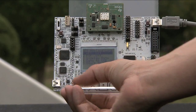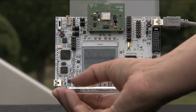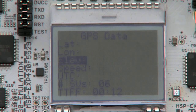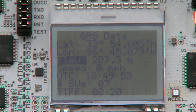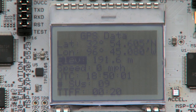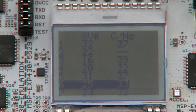We'll select the GPS applications menu, turn on GPS and push-to-fix by using select 1. Now we will go to the display menu and wait for the CC4000 to get a location fix. When the GPS solution gets a fix with the satellites, the data menu is populated. Here you will see time to first fix or TTFF, latitude, longitude, elevation, speed, UTC or time, and number of SV or satellite vehicles. Now you are seeing this data on the display in real time. Now we'll select the SV menu or satellite vehicle menu to see the satellite carrier to noise ratio, which is your signal quality for the satellites.